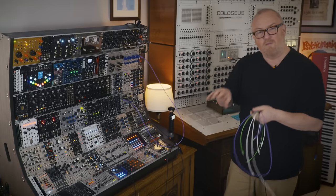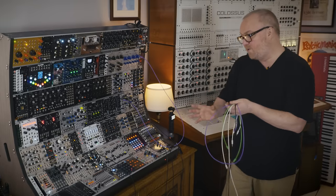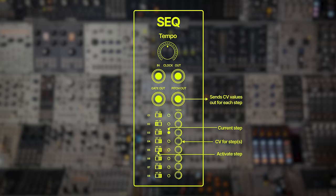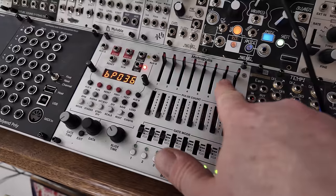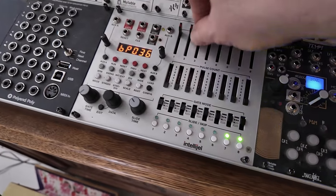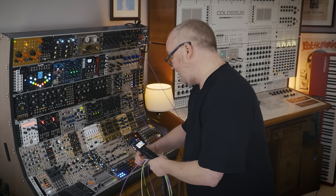This is possibly the most complicated one — it's a sequencer. A sequencer uses a series of steps to output different levels of control voltage. This switch activates a step, this dial sets the control voltage amount for that step, and this LED illustrates which step is being played. The different control voltages are outputted here. We'll return to the sequencer in a bit, but let's see these principles at play. There's a bunch of steps and controls — so let's just go into pitch.